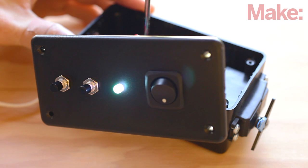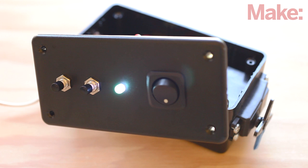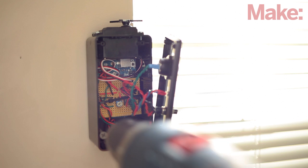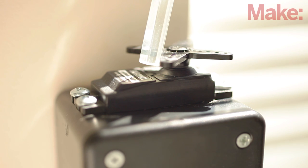Next, you'll need to do a few calibration tests for your specific Mini Blinds. It's really easy — just follow the steps found on the project page and you will be ready to go in just a few minutes. To permanently install your project, attach the case to the window frame with two wood screws. Position it vertically so that your blind's wand fits between the spokes of the servo horn, but doesn't hit the top of the servo.